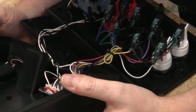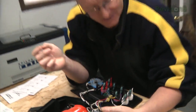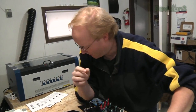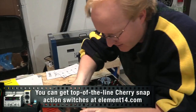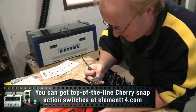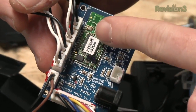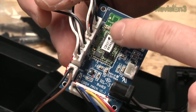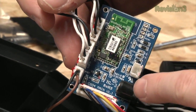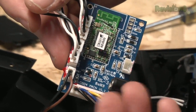Since it's a Bluetooth device, it will require power. So we can either try to use button cells or perhaps steal the power off the iPhone device itself. It's got a Bluetooth antenna right here. Here are our four joystick directions, here are our buttons, this is just a light for the coin slot so this is irrelevant, and there's the Bluetooth module. We can actually flatten this quite a bit — we'll remove all these headers and make a pretty thin circuit board that I think we could easily fit inside of a sleeve or a clip around the iPhone.